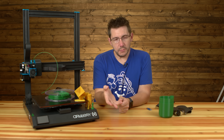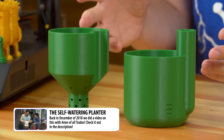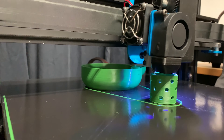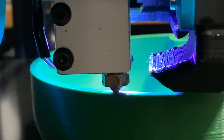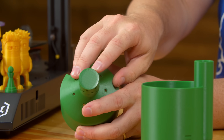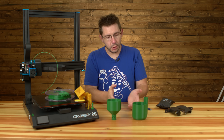Lastly, I wanted to get something that took a while to print, had multiple pieces that would fit together, and might have trouble sticking to the build plate. This is a planter — I printed it larger before and filled it with dirt to rescue a plant. The idea was to print this with a lot of perimeters to make it almost solid, watertight, and have it fit into itself. It fit just fine. The bottom looks pretty good. It looks like the build plate heat may have affected the first five millimeters or so, but for a functional print, that really doesn't matter.